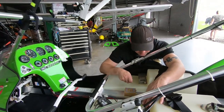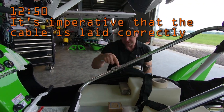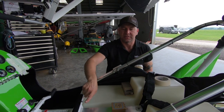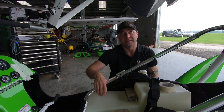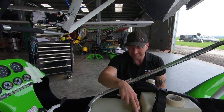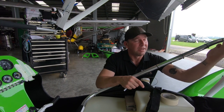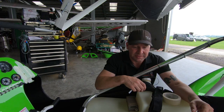What are we installing at this moment in time, sir? Placement. So the issue you've got is that these can be quite tall, and when you put the seat pan in, there's a recess that comes down here. So if you move stuff too far down here, you don't realise your seat doesn't go in until you've put it in. So, like I say, getting placement right. If we put them on the keel, you've got to be mindful of the main pylon coming down. So yeah, placement is quite important.